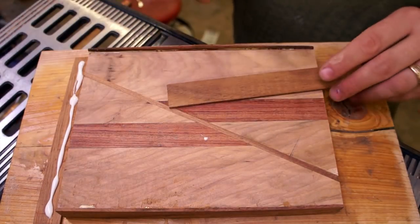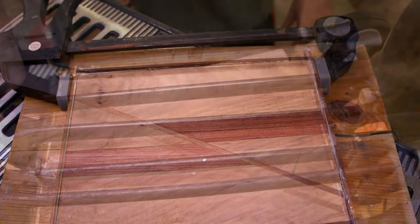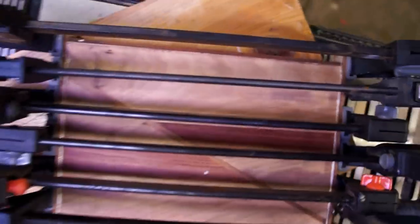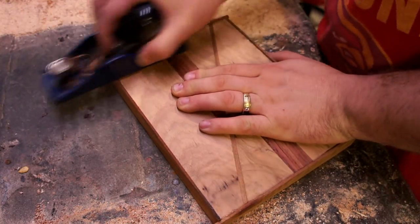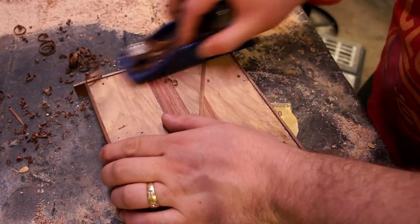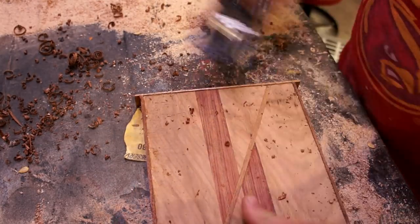After I got that maple cut I realized I had a bunch more of this koa wood and thought it would be cool to do one extra frame around it — one more layer. So I did one side, glued it, let it dry, cut the ends flush, then got the other side glued on. Just like before, to save myself sanding I'm taking off the tall edges and getting it pretty flush with a hand plane. Honestly just making all these shavings is so much more gratifying than using an orbital sander.